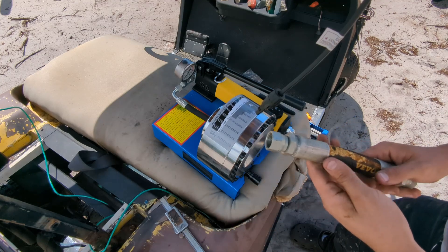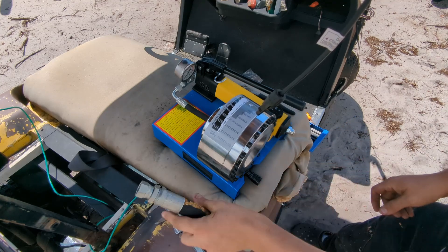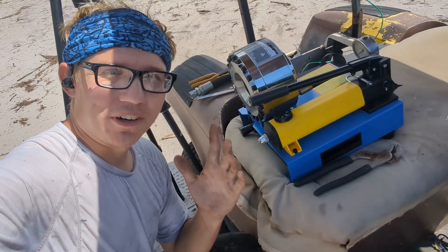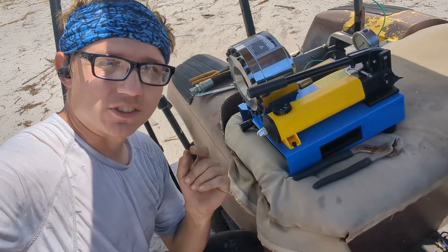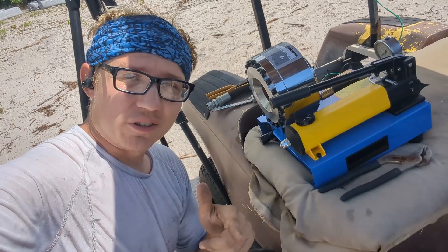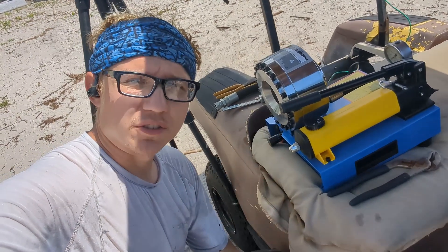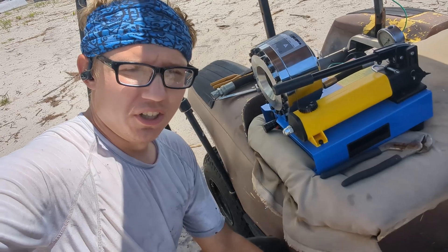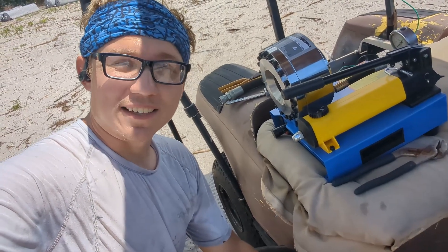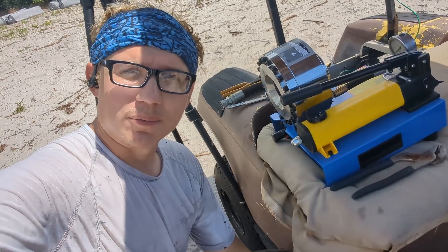We measure it and we got 30.5 — close enough, perfect. It works. Always good to measure with a caliper afterwards to make sure it's the right diameter, and you might have to play around with it to get used to it. I've got a lot of projects going on — I just finished rebuilding an excavator, just need to get the rods rechromed at a hydraulic shop and it'll be fully working. Hope you liked the video, subscribe for more soon.